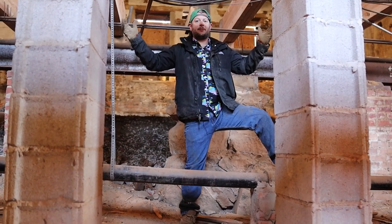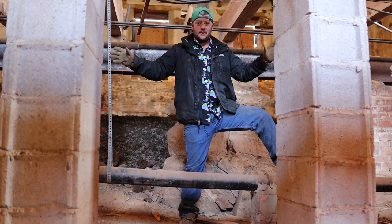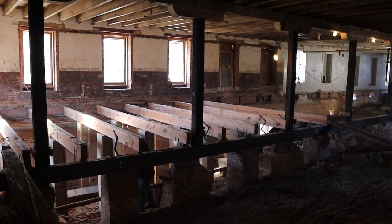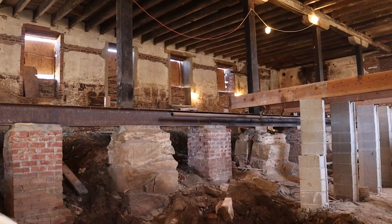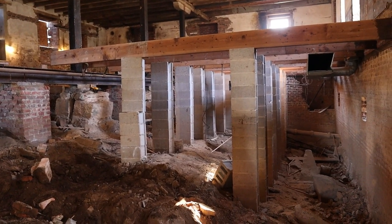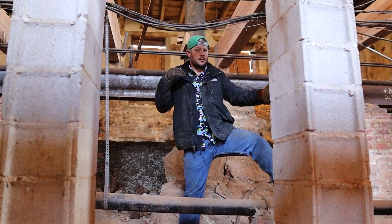We made it through most of the floor — officially all of the tongue-and-groove out of the first floor. That was one of the most difficult things I've ever had to demo. Those boards were two and a half inches thick by seven and a half inches wide, secured every four feet with eight-inch spikes. We couldn't just tear it up and throw it away — that floor had to be disassembled so we could reuse all of that historic fabric. We got some really cool boards out of it that we're going to use to build our bar and maybe some furniture in the cocktail bar area.